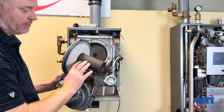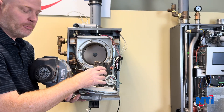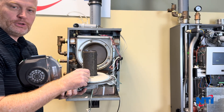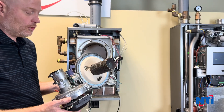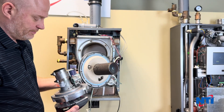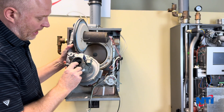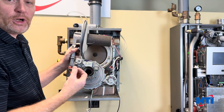At this point, inspect your burner and make sure the fiber mesh is in good condition. Any tears or significant holes — anything bigger than about the size of a dime — and you should consider replacing the burner. Have a look at your igniter; generally speaking these will last about two, maybe three seasons, after which you should proactively replace them. Flame rods last a little longer — more like five years — and after that time I would also proactively replace it just to be safe. Always inspect the venturi to make sure it's not too dusty or dirty. This one has a fairly normal amount of dust, but anything significantly more than this should probably be cleaned, or you should look at your air intake location.